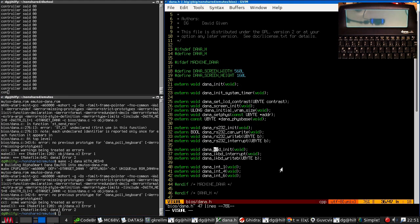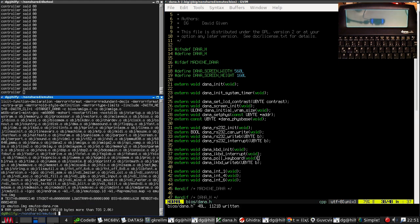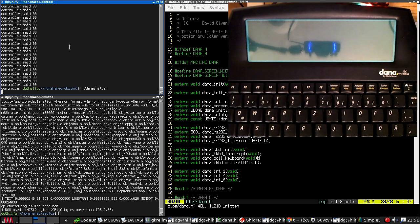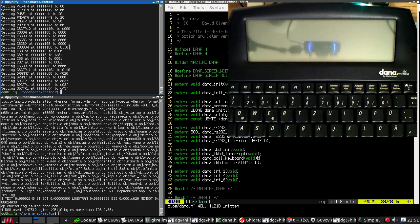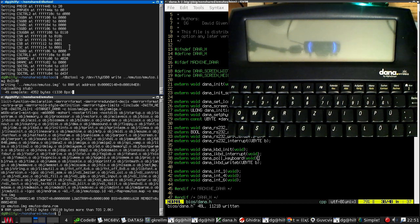Accessing the individual pins is very irritating because they are all on different ports, and all the ports are volatile, so you have to manually handle reading and writing multiple bits in multiple different ports, and it's all ghastly. I did originally think of using bit fields for them. But the problem with bit fields is that you end up setting and reading them one at a time. And because the registers are volatile, that means each one turns into an individual read or write, which again is not right.